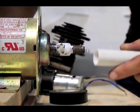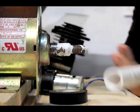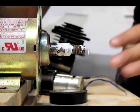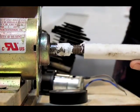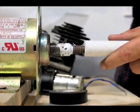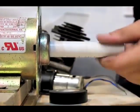We have our piece of PVC here, and I actually cut that with a chop saw. If you use a really sharp blade and go nice and slow, PVC cuts perfect. You just want to make sure you wear proper eye protection and don't put your hands anywhere near it. Be careful because occasionally a piece will grab and fly. I've cut a lot of PVC this way — my brother-in-law showed me how to do it. I didn't think it was possible and I used to cut everything with just regular PVC cutters. Those work too, but if you know what you're doing, it's a lot faster.